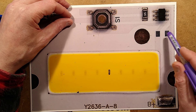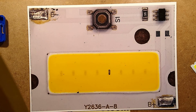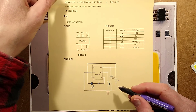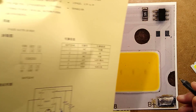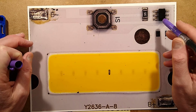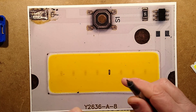After a while it would heat up the plate and stabilize — it could get quite hot right behind the batteries, though I'm not sure that would affect them much. That was with emulated 4.5V fresh alkalines; with internal resistance it would be lower. I'd recommend using rechargeable cells. The two mystery pads are effectively across the LEDs, which is odd — it deviates from the manufacturer's guideline. Instead of putting the resistor in series with the LED, they've put it in series with the negative battery connection, which means if the chip failed and shorted, the resistor would limit current and likely blow like a fuse.